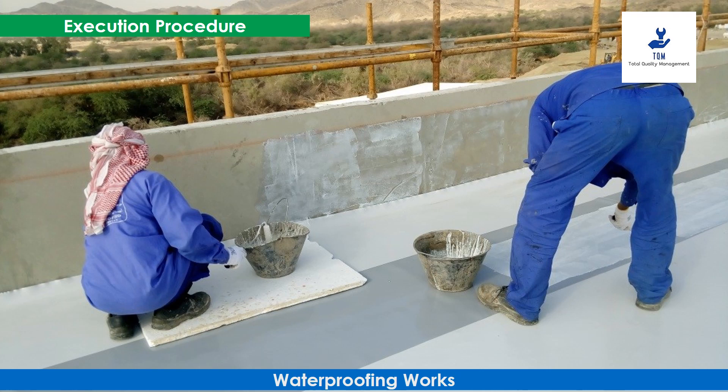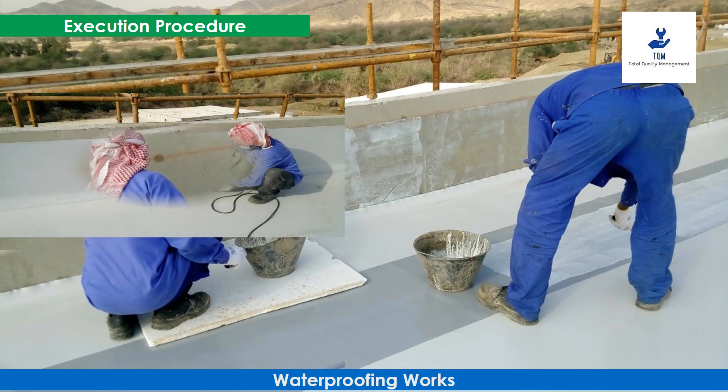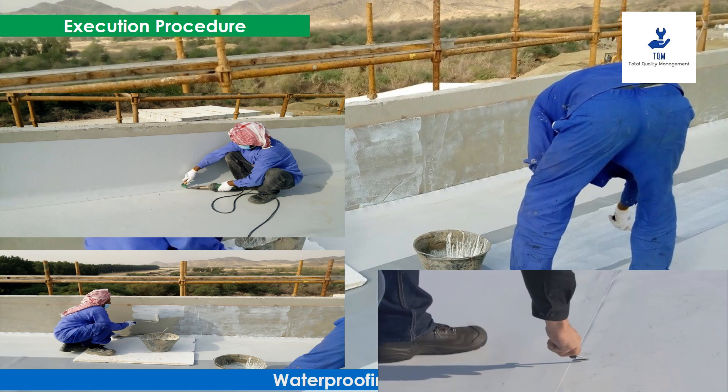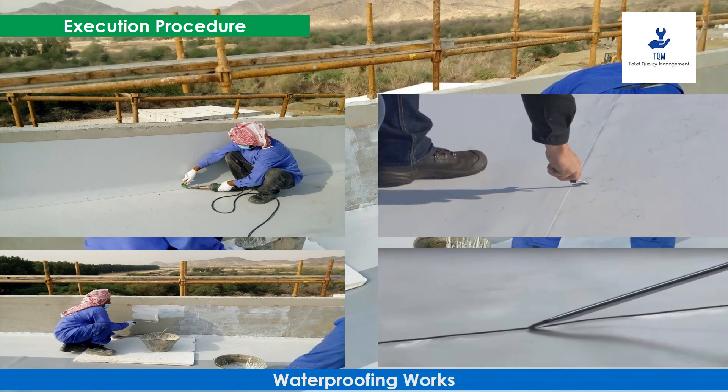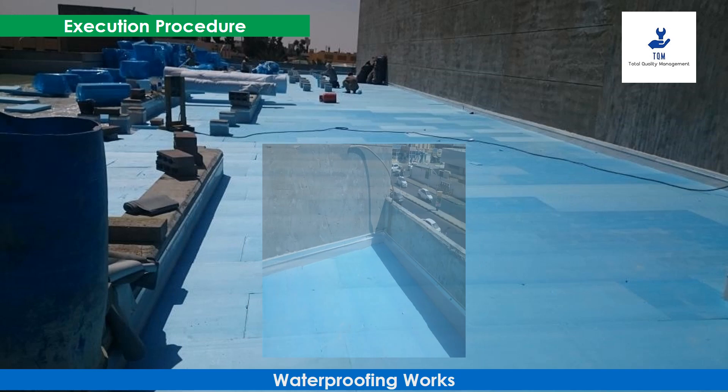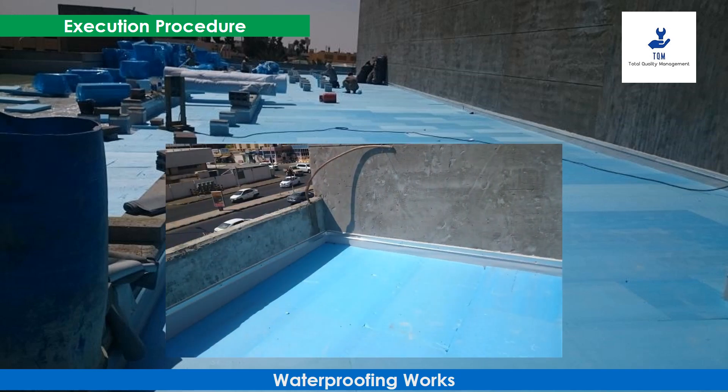The vertical PVC membrane shall be UV-resistant stabilized, bonded to the parapet wall, and terminated at the groove or chase. PVC membrane adherency shall be verified with the help of suitable tools shown in the video for proper membrane-to-membrane bonding. After that, a separation layer of polyethylene film sheeting 200 microns thick is provided, and a minimum 100 millimeters thick extruded polystyrene rigid thermal roof insulation is required.